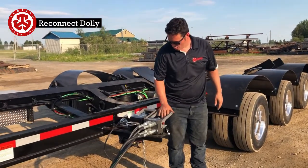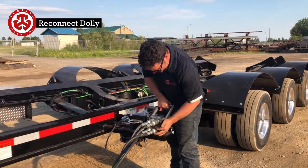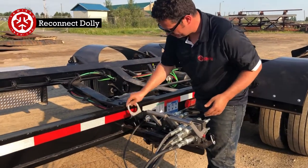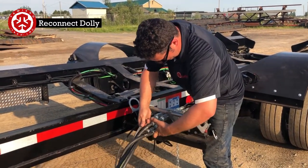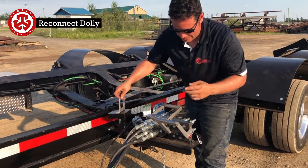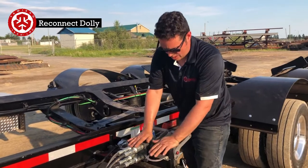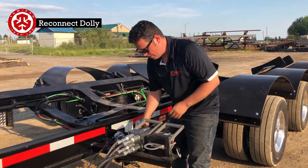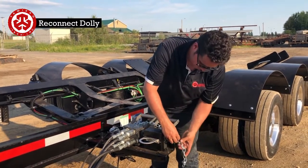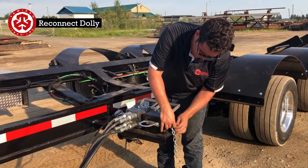And then this here, right now it's on auto, so I'd be able to adjust the steering. What I can do now, since it is lined up at the back, is put this on bypass, so that it pulls like a regular trailer. If not, it won't damage anything when you're empty. The only thing is you might forget that you have it, and you might swipe another car. So right now this is dead-headed, it's locked. Here we have these, we're on bypass. I'm going to lock this so nobody plays a cruel joke on you.